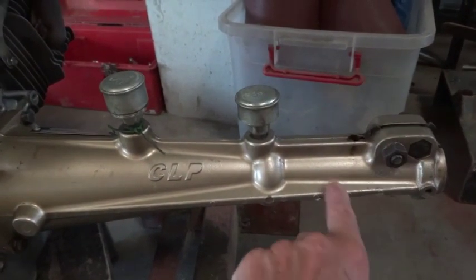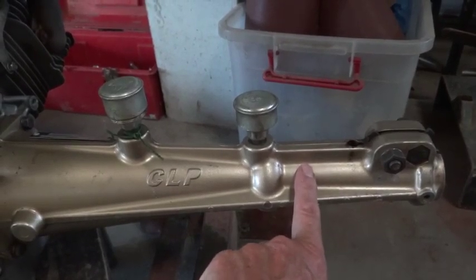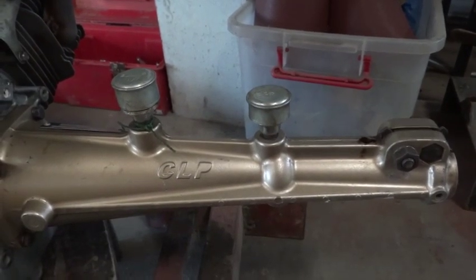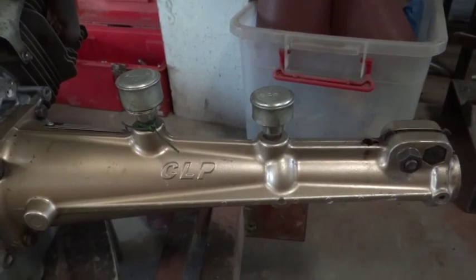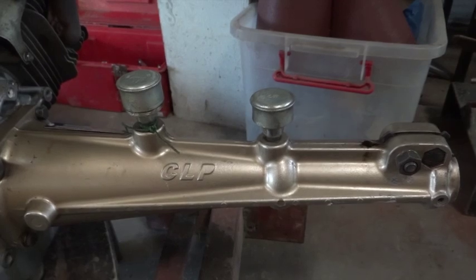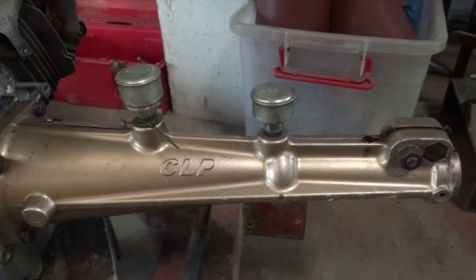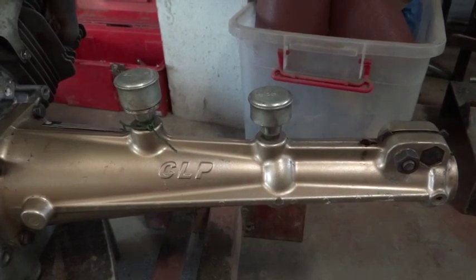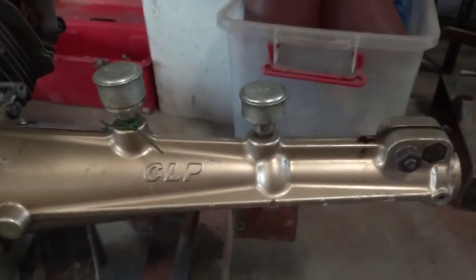You clamp it down here, and through here you've got that keyway — a female part in here and the male part on the end of the shaft — and that provides a little slop. It doesn't have to be a tight fit; if it's too tight, it'll bind. Because there's no thrust load on the bearing, you don't need a tapered heavy-duty bearing — just a high-speed bearing rated around 3,500 RPM, but get the best one you can. Keep a lot of grease in there, and on a homemade unit you may want to drill some holes in the bottom to let water drain out.